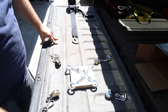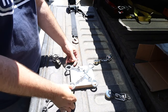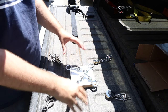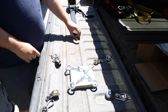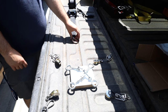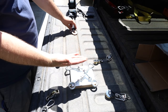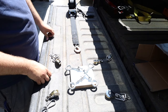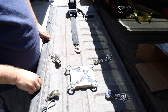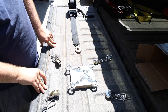This white piece is the bed frame. We're going to put four eyelets on all four corners, and from those eyelets we're going to tie rope off and run it up to the four corners of the ceiling with pulleys. From those four pulleys we'll run the rope over to a latch connected to a hand crank mounted in the front of the trailer. When you crank the hand crank, that'll pull the ropes and lift the bed up. Right now we're doing it by hand as a two-man operation — this will make it a one-man operation.